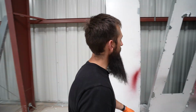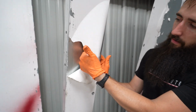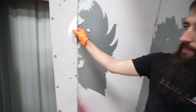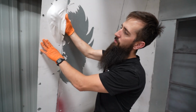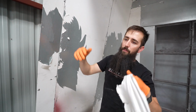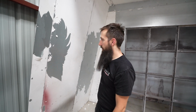All right, so on the inside of this booth, there's this stuff they call booth coat. But look at that. It pretty much just pops off. We started doing that, and then we realized that we would be here for probably another 2 days just cleaning off the panels. We're just gonna get off all the pieces that are thick, coming off easily, like that. We're gonna try to get some more of this booth coating stuff, or maybe we'll just get some cheap white latex paint. It'll pretty much do the same thing. It probably won't be as nice. But the issue was some spots were really thick, and the other spots over there were just thin and they don't come off.